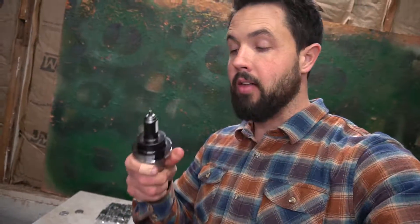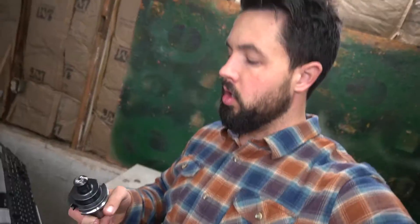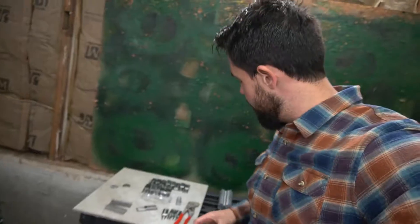The tools we're going to be using for this particular operation are, first and foremost, the Lakeshore Carbide 5 Flute Variable Helix Endmill. This is a battle axe when it comes to cutting 304 stainless — it cuts very well, except for when you're an idiot and you break it. So we're going to have to replace this, and then we can start cutting. The next tool is this 3 Flute Accu-Size Cutter I got off Amazon — works really good for facing operations. The next tool is this corner rounding end mill — it goes around the top and makes nice smooth corners so we don't leave burrs and jagged edges on our stainless steel. Lastly, we're going to be using this 1/8 inch ball end mill from Lakeshore Carbide to clean up any burrs on the repair tool.